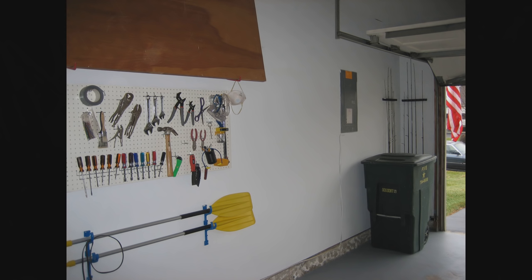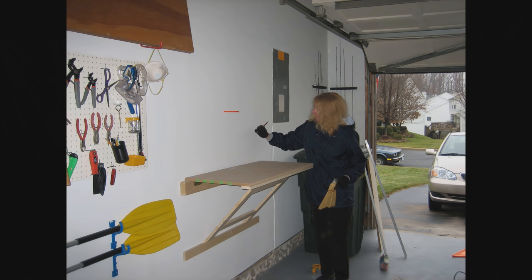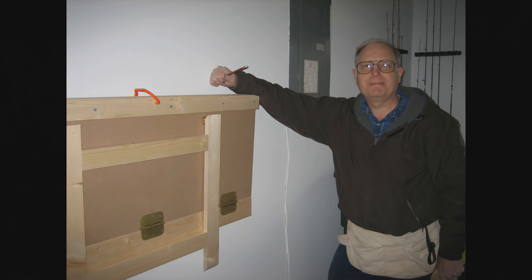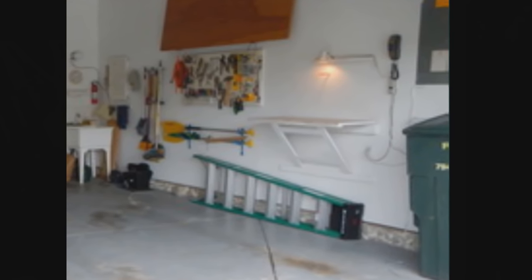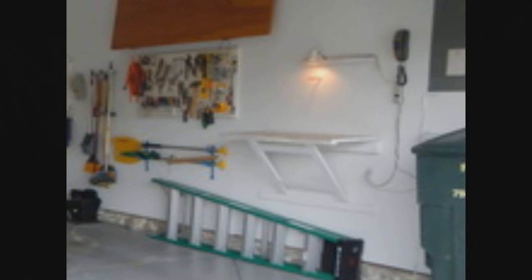I've got the joy of having a big shop out here in the final house I'm going to live in, but you don't really need this much room to have the same thing. All you really need is an empty spot on a wall. In my last house I picked one in my garage, got a piece of MDF and a couple of hinges, and made a table that would fold up and then fold down when I needed it, with a big hook to keep it up and out of the way. Later I added a mount for a light as well as a plug for that light and anything else electronic I needed. You don't need much to make one of these — and that bent nail is the key component.